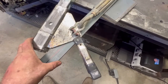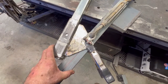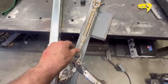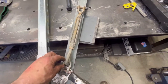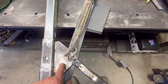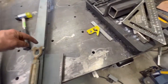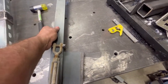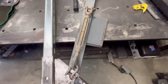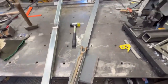This will come down and attach to the center of the boom. Then I'm going to have a half-inch turnbuckle attached to this front pad eye. This rod is going to be cut up here — this end will attach right to this flat stock. I'll get that cleaned up and adjusted out. That will give me a little bit of adjustability if there's any deflection.